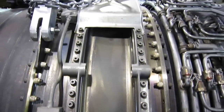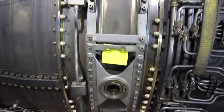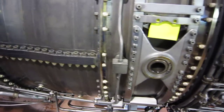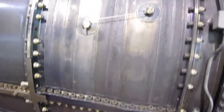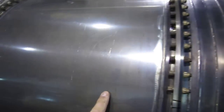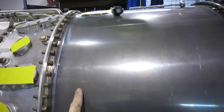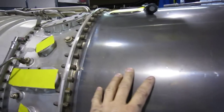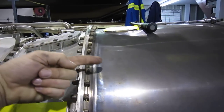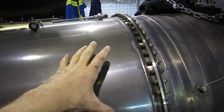You'll notice that there's no large bolts — they're all quite small. The fasteners on these extremely powerful engines are quite small. This is the turbine case; the turbines are whizzing away inside there. This is the combustor outer case; the combustor liners are in there. The fuel is burnt right in here. The fuel nozzles go into these holes and sit about there inside the combustor liners. All the fire's happening in there.